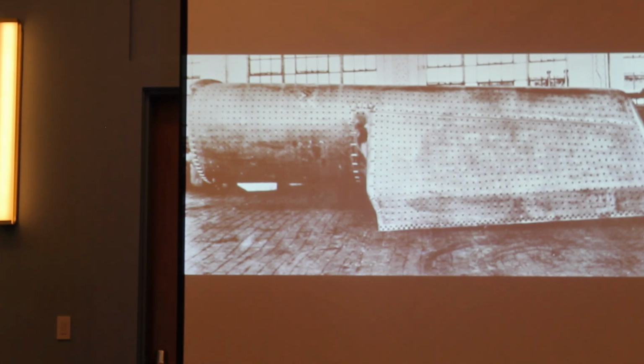That looks pretty good. What the N&W did was, when you take a tube out of a boiler, you have to cut each end out of the tube sheet. It's the front tube sheet and the rear tube sheet. And then you take it out. Many times they had what's called a king hole in 1 or 2 places in the front tube sheet. You get that tube out first. It's bigger than the rest of the tube holes are. You get that first tube out of there, and then you start cutting tubes. You can pull the ones you're cutting out through the king hole. That's what it was for.